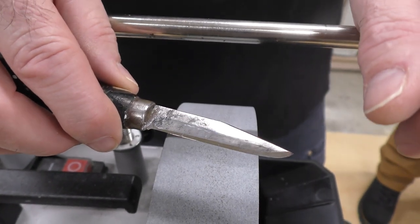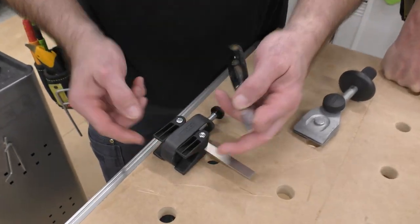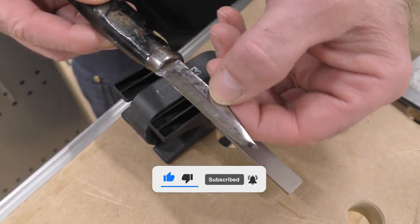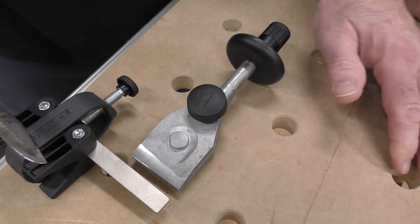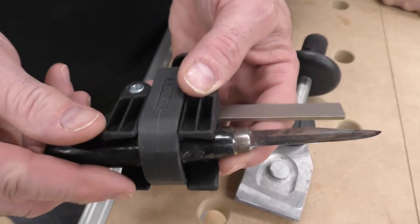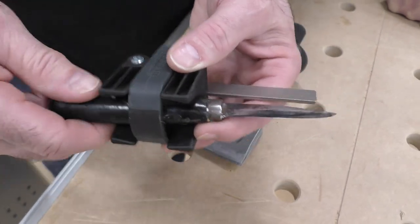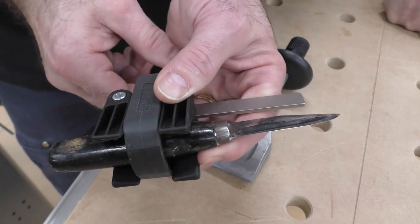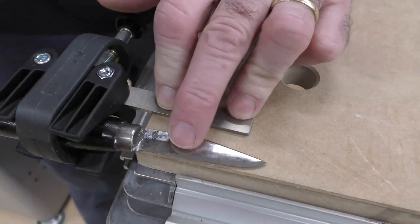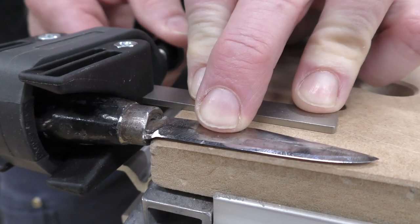When you look at the small knife sharpening jig, this part here holds the handle. This part aligns the flat of the back of the bevel here. We'll use our knife sharpening jig on there to hold it. We slide it in here — I like to put it right about here so I have a good grip — and then tighten it. Get it so it's not canted, right in the middle of the handle. See that flat right there? You've got to make sure you get a flat surface, put flat to flat, and tighten it up. And it is that simple.